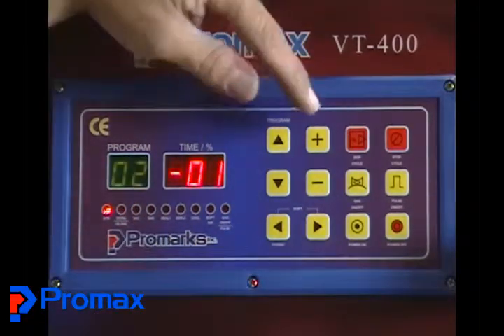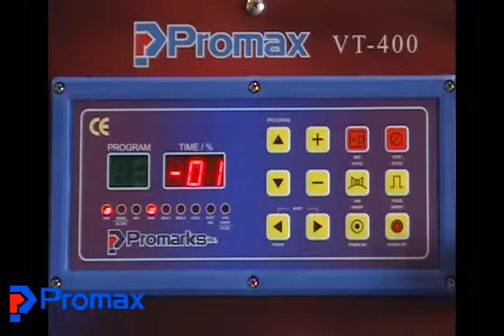Shift over to gas. You're going to need an amount of gas equal to the amount of vacuum pressure, so it's really important to pay attention to your vacuum gauge. When you pull a complete full vacuum, you have to equalize the pressure back with an equal amount of gas — or oxygen — that you remove, to equalize the pressure in the tray. If you don't, you'll crush the tray if you don't have enough gas, or you'll pop the tray or waste gas by over-gassing. The same amount of vacuum you take out should equal the same amount of gas you put in. You can be slightly higher for a convex tray or slightly lower for a concave tray.